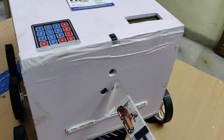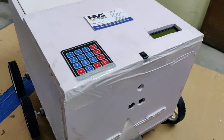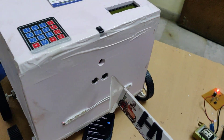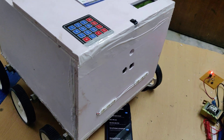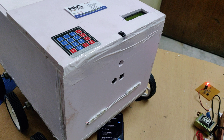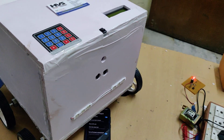The ESP32 camera provides live streaming, and based on input from our browser, it informs the PIC microcontroller. By viewing the visuals, we can control the robot's movement in forward, backward, left, and right directions. When moving forward and an obstacle is detected, the system stops and turns on the blue lights underneath to indicate the obstacle.